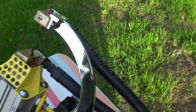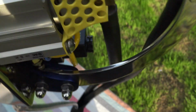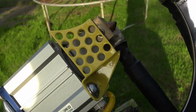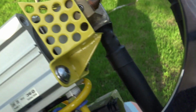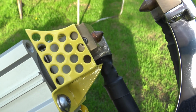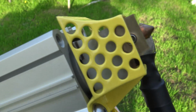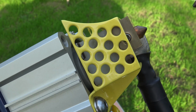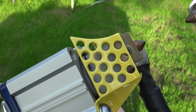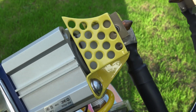It happened to me before when I used to work out in industry. There's a lot going on behind this guard too. You have an insulator that breaks the winding. So if that insulator wasn't there, the secondary winding would already be linked together, if that makes sense, through the spot welder. So there's an insulator in there, and it's a piece of nylon block, so it needs to be hard and solid. I'm going to take it apart in parts later on and show you how it's done.